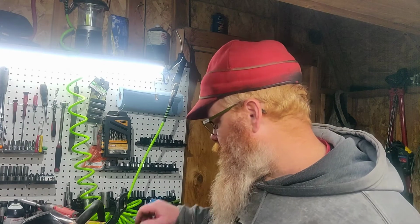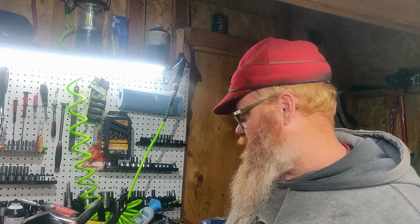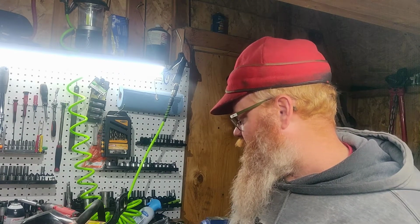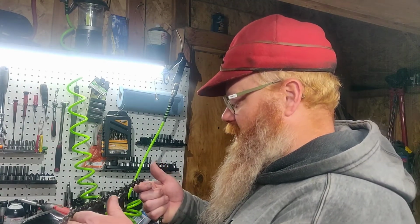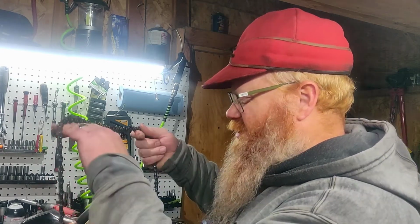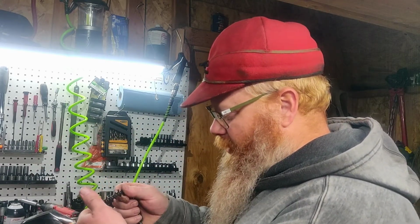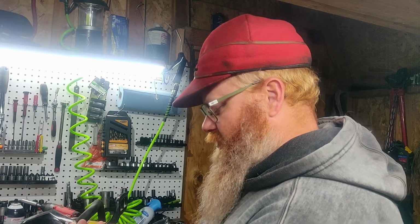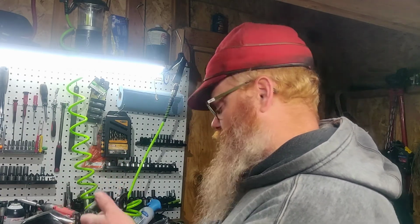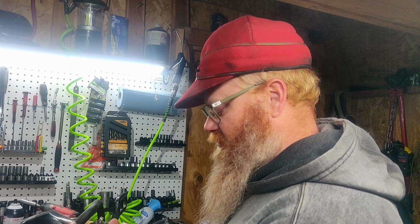So, in my next video, which I'm hoping I can do tomorrow, I'll compare this full skip semi-chisel chain to this full house chisel chain. This particular chain, this is Husqvarna chain that I have filed a few times, set my rakers on. This cuts really good. This chain could use a little touch up, but I just cut with it the other day and it still cut really good.